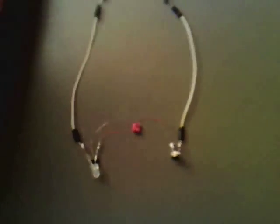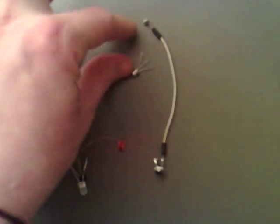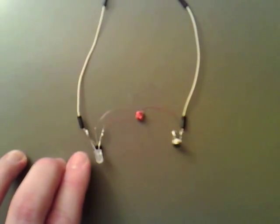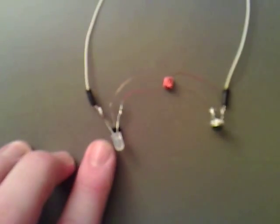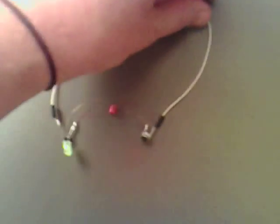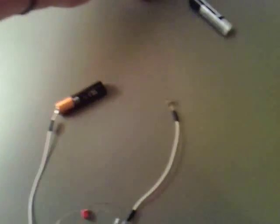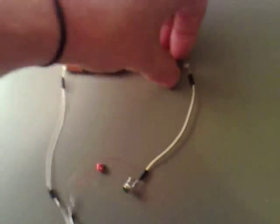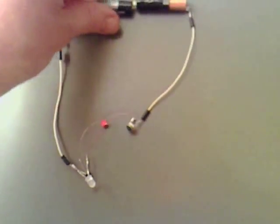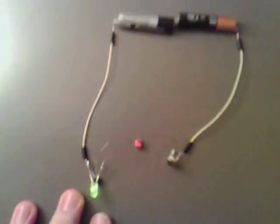The finished circuit — I've had to replace the 2N2222 because it just didn't work, and I put a BC547 transistor in instead that I just had knocking around. If we put the battery across there you can see it lights up green. When you reverse the battery, I've noticed there's not enough current in this battery to light it red, but if we put one more in, you've got your red, and if you take it round again the other way, you've got your green. So you've got a nice polarity checker there as well.